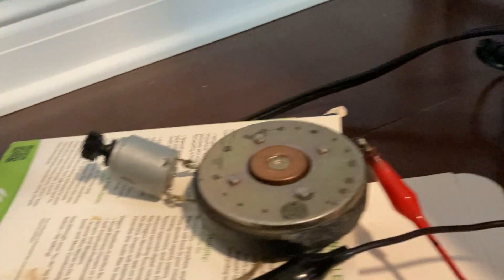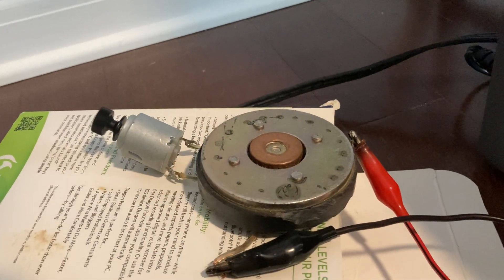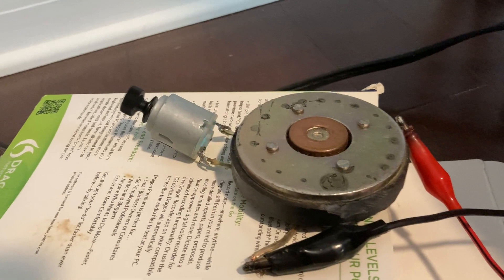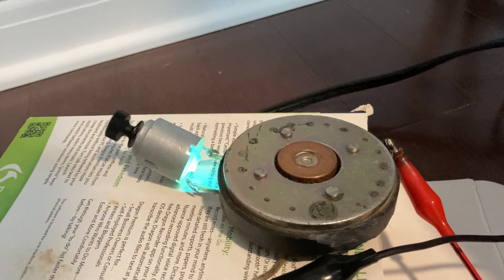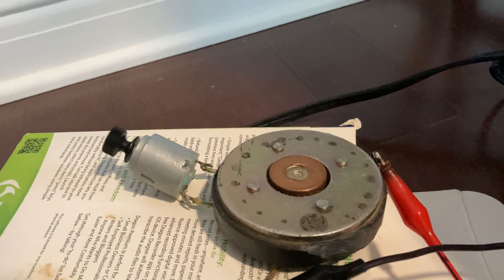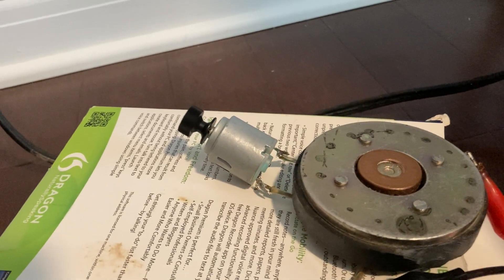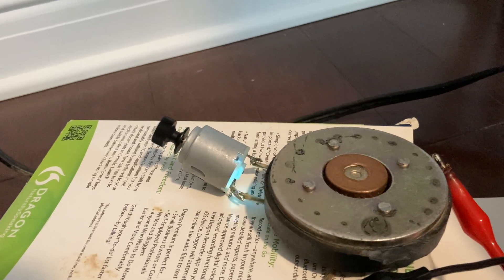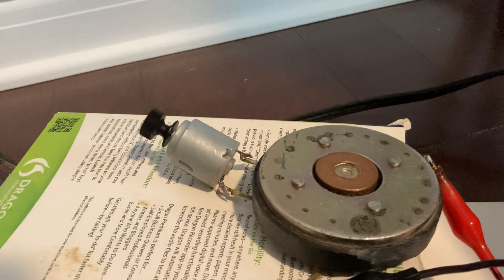It's still alive, I'm just gonna see. It's only warm actually, it's not like burning hot yet. 0.7 amps. The current draw is increasing, still hasn't gone above an amp. Uh oh. Current draw is staying the same but it smells bad and is slowing way down, and the voltage is staying the same.